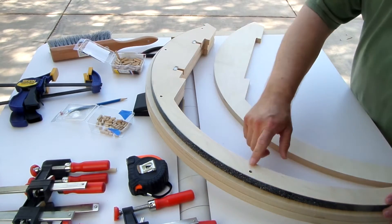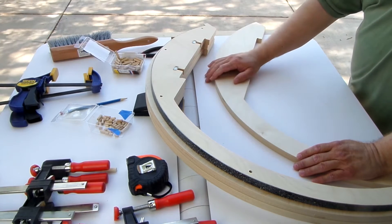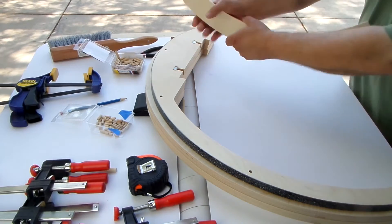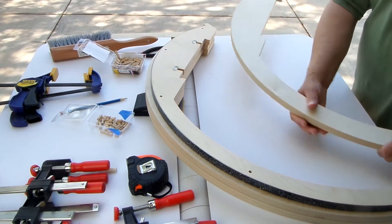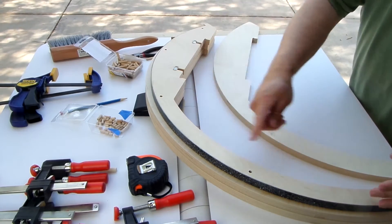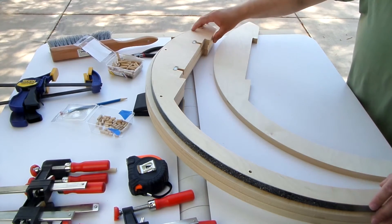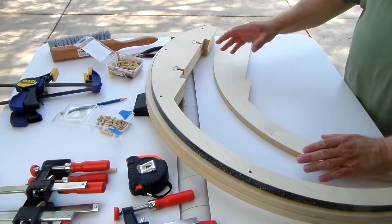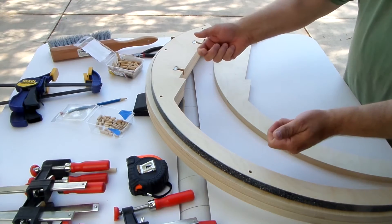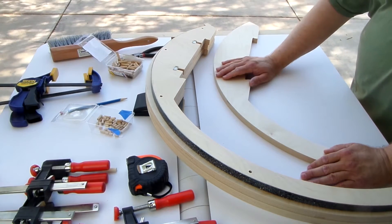You can also see some other features here. We've got a bunch of holes drilled in here, and these holes were put in place on the CNC machine. The CNC machine is accurate to about a thousandth of an inch, so I use this technique of drilling holes to give us perfect alignment. On the other side of this piece it has matching holes, and by using pins — which are actually just quarter-inch dowels — you drop those in the holes. This piece has five aligned holes; when you get five pins in there you can put the thing together and get exact, perfect alignment of all four pieces. It also really helps during the glue-up because with the pins in there the pieces cannot move around, so you get literally a perfect alignment every time.